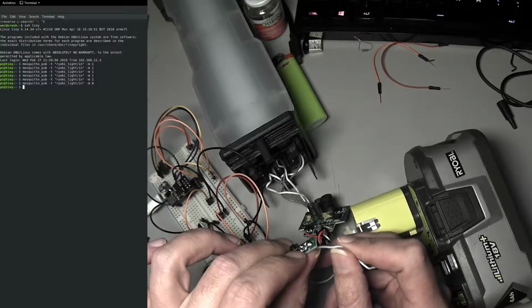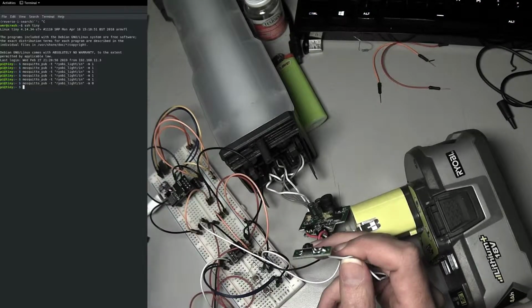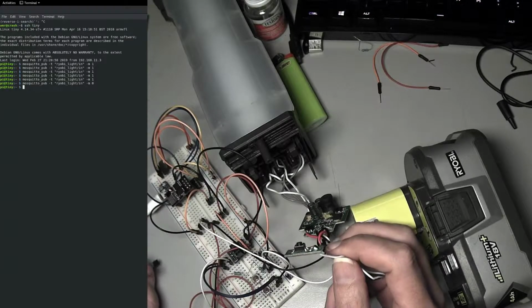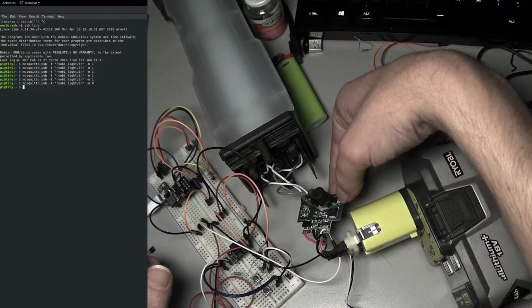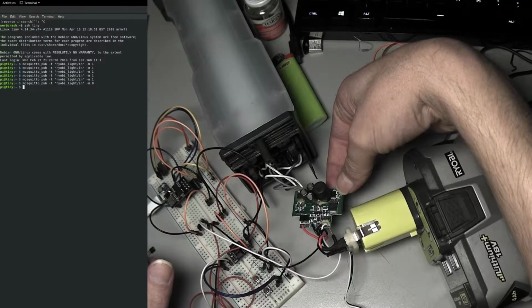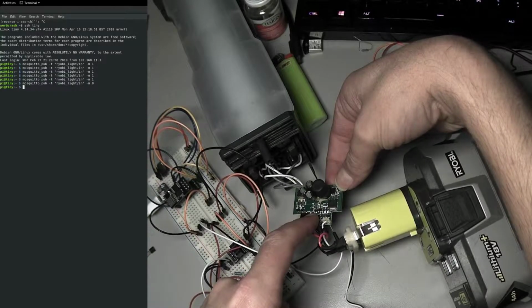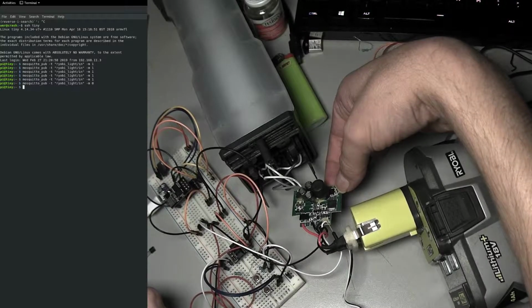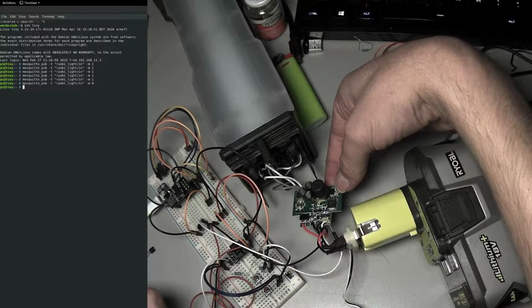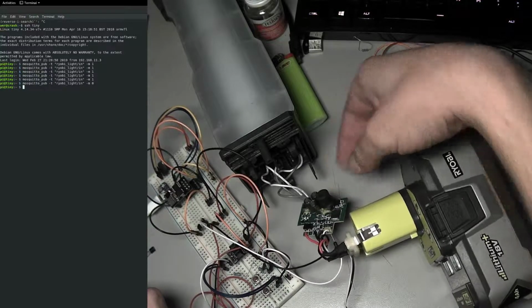Oh, so there was 18 volts across the switch. Once it's on, I see 3.3 volts here. So anyway, I used the MOSFET to protect this dude because I wasn't really sure about that. And then this whole circuit isn't pulling any power until you short it, right? So at first my thinking was that I'll just pull off wherever the 3.3 volt regulator is on this thing to power this thing. But this guy doesn't get any power until you power it up, or it's an unusable amount of power, or I haven't probed enough to really find it. And it's possible I did something stupid there, so maybe a quick look at this is worthwhile.